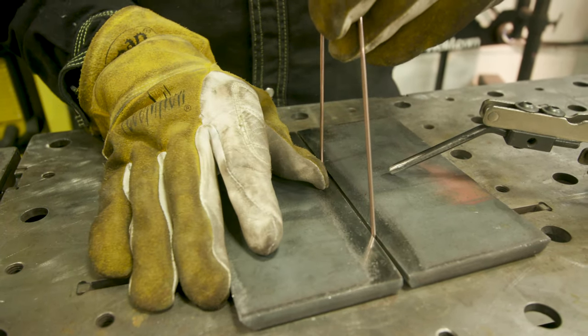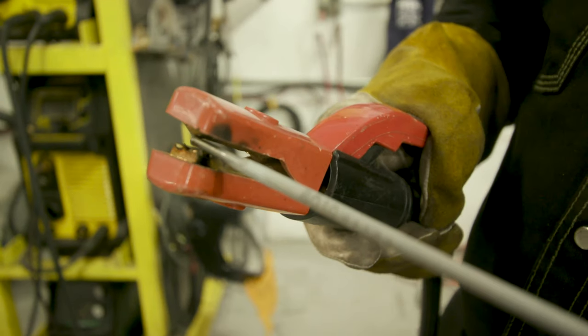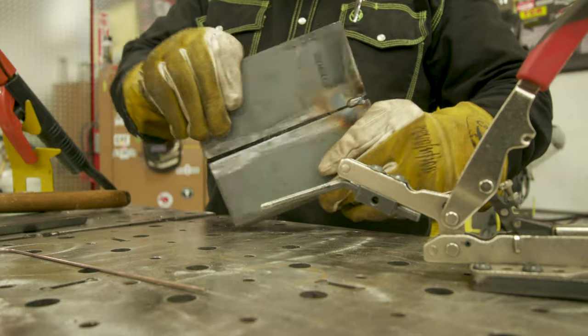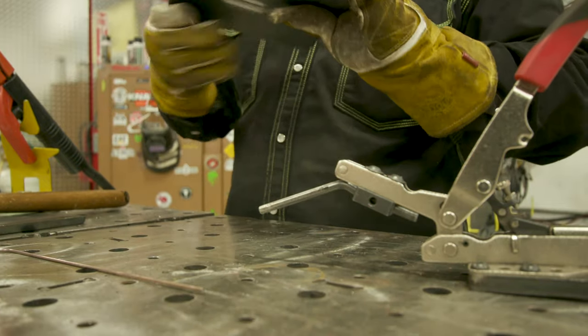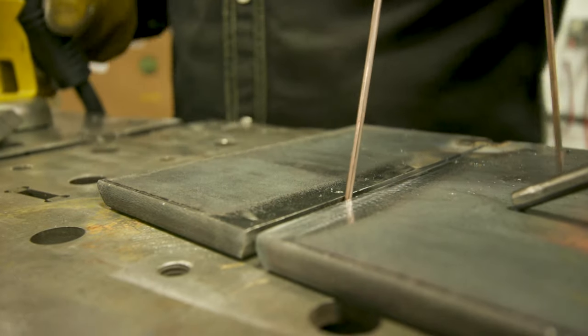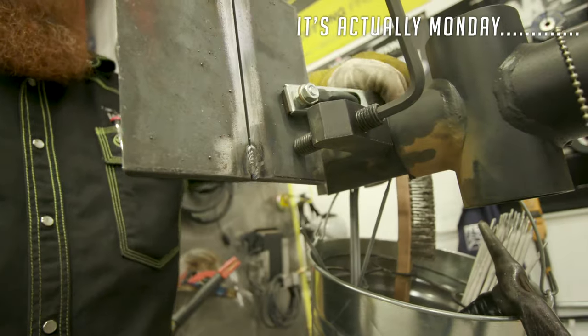I have a piece of three thirty-second TIG rod — I'm just going to bend this into a little horseshoe and stick that in there to help me keep my plate spacing right where I want it. I'm going to start with the right side first, get that tacked in, then verify the gap prior to welding the other side. If I weld one side it's going to open up on the other, so I'll tap it back together, re-verify with the TIG filler wire, and then tack it up. We're going to throw this up in the stand and do some vertical — it's Friday, why not.